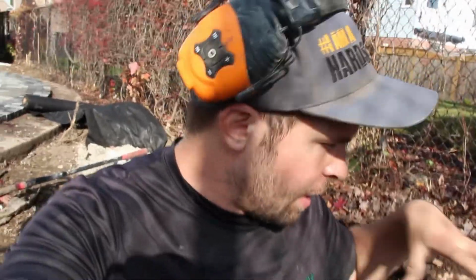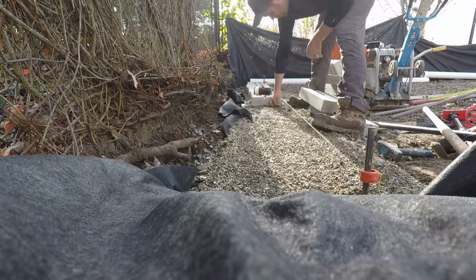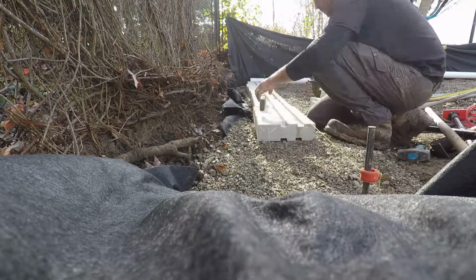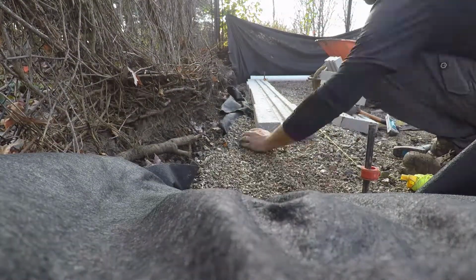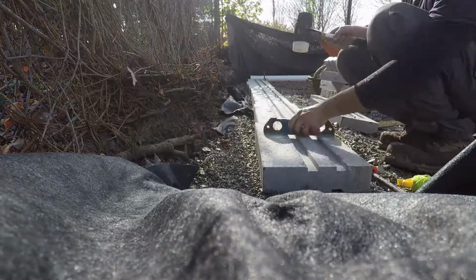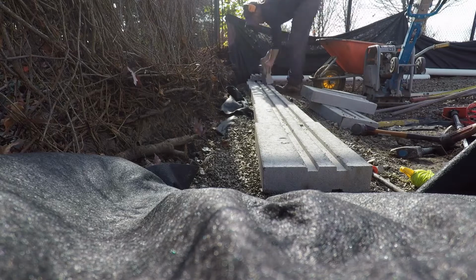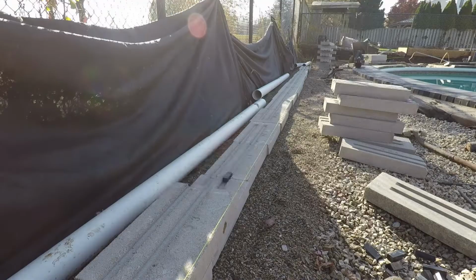See, my return here actually took me longer to level each block just because I only roughly screeded that out to give me a surface that I could work off of. So it shows you how important screeding was on this side of the wall and that we're accurate. By the time we were moving along with this one, it went much faster than this small return here, which wasn't that much. So screeding for a wall really speeds things up.